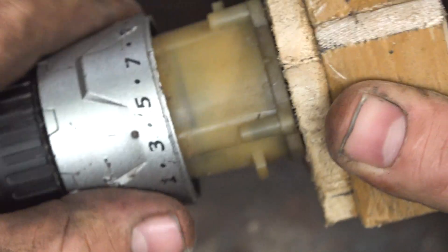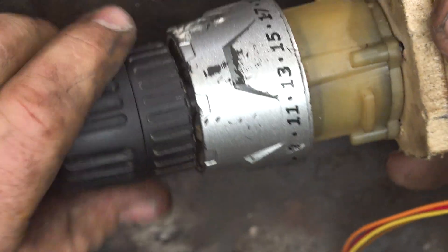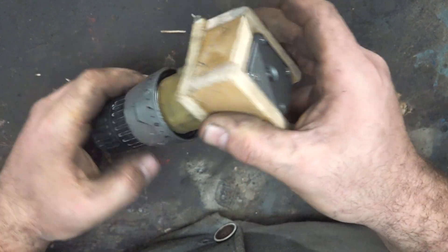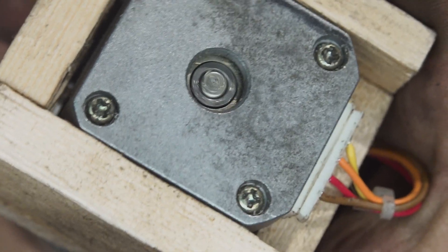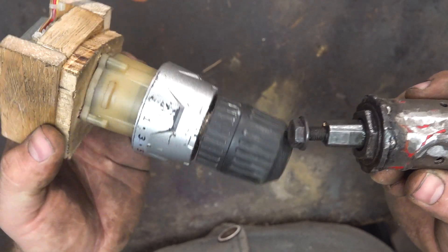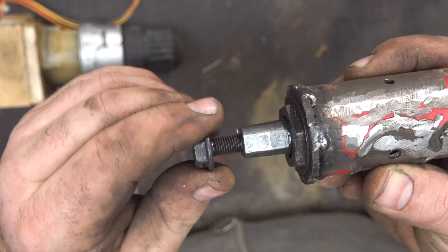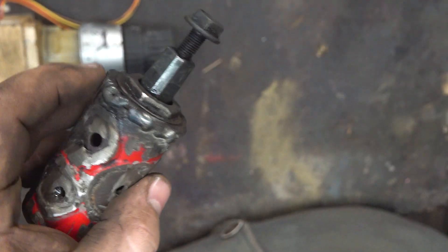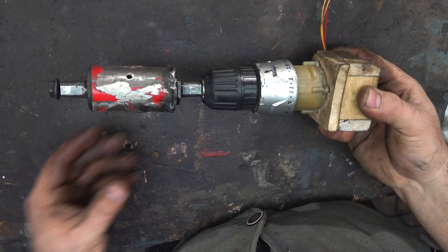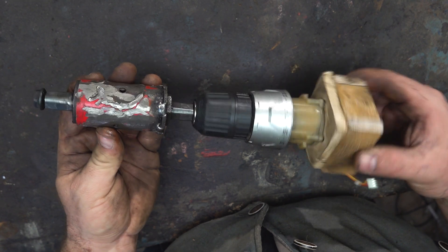Finally the friction really works — there are 17 positions for the friction. At the lowest setting, I can move the chuck freely because the friction slips and the gears inside the motor are essentially disconnected. If I tighten the friction all the way, the gears are connected directly to the chuck, which can be a big problem. To connect the chuck to the ball bearings of the bicycle pedals, I save the original screw, cut away the head, and connect the chuck to it — everything spins very smooth and it's a very secure connection.